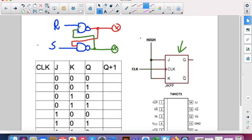We checked last week that when we have a zero on the reset input, we have a signal here and the opposite on the other output. So we checked that flip-flop last week. Today we are going to use the JK flip-flop, which is similar but used for doing something different — a counter — and we want to count in digital and convert to decimal with the BCD seven-segment display.